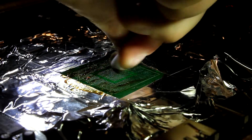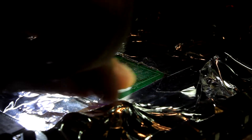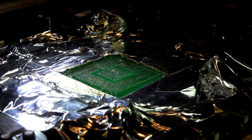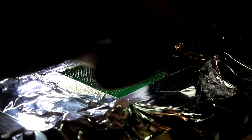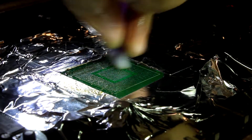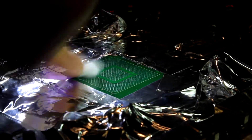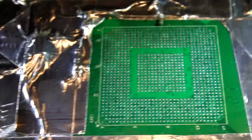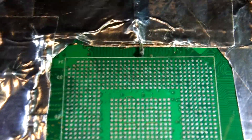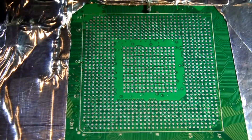While the flux is still warm, you can clean it up the best you can. The board is at 40 degrees Celsius, so take some IPA on Q-tips and just start cleaning up. Drag your finger to make sure there's no high spots or anything like that — and that's good. You can see it's nice and clean.